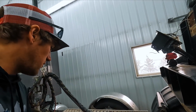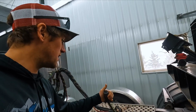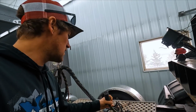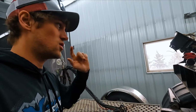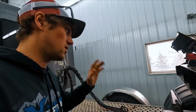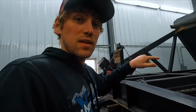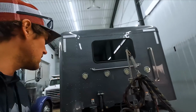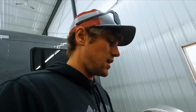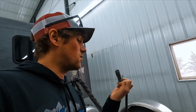How it was wired before was the 7-pin, the center pin that's normally for your ABS controllers on newer trailers, was actually switched on our other trucks. Like a switch in the cab, you could power it up and turn it off. And that was actually how this trailer dumped its belly. This truck doesn't have it, nor does this one, and I don't want to cut apart the harnessing. So we're going to wire it into our third axle lower switch.